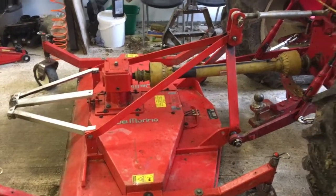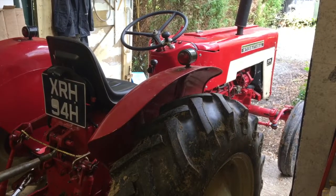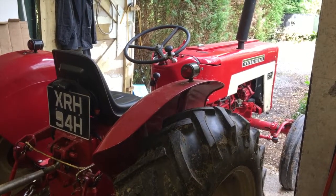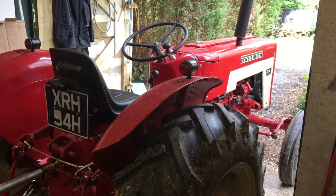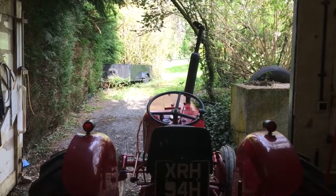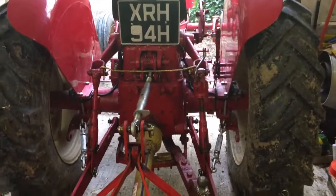So the next video is going to be the annual service on the International. And that will be done, it's relatively straightforward. It's really just oil filter, fuel filter. We'll clean out the air filter oil bath, make sure that that's nice and clean and get some fresh oil in there. I am going to reset the tappets because I'm detecting a little bit of tappet noise on this engine. And then you can probably see my exhaust pipe is not particularly straight. That's the problem with having trees all the way around the field. Unfortunately, they do sometimes get in the way.